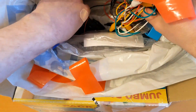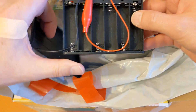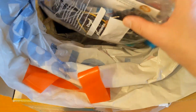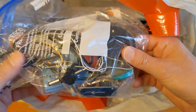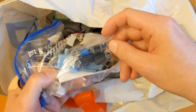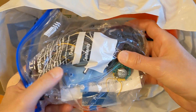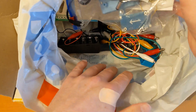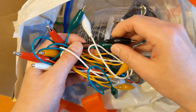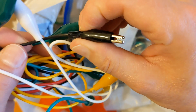Here we've got a couple of little projects I was working on. Ages ago I put six quite flat double-A batteries into a battery holder, bought a buck boost converter, and wired it up to output USB so I could use it to charge things. Unfortunately, I didn't have a capacitor to smooth it out, connected it to a power bank, and blew the power bank - which was for some Bluetooth headphones, so it was quite expensive. Major fail on my part.